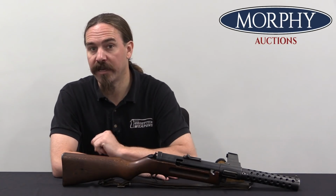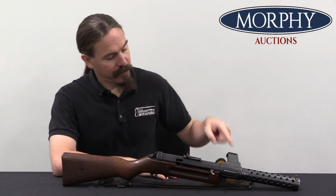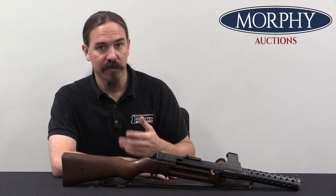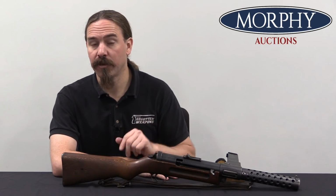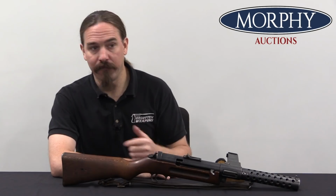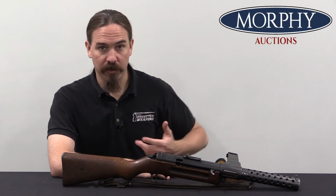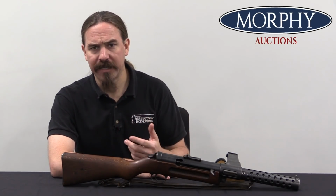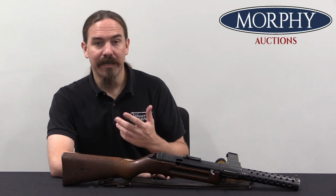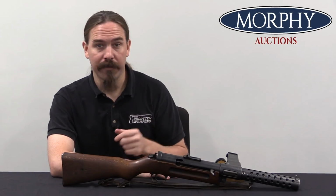I'm Ian McCollum and I'm here today at Morphy's with an MP-18-1 with Schmeisser's box magazine improvement to it. Now, when the MP-18 first saw combat use, when it was first developed during World War I, it was built around a Luger, quote-unquote, snail drum magazine, a round single-stack 32-round capacity drum that had been originally developed for the artillery Luger. It was a magazine that was available, that was in production, and thus made logistical sense for the German military to use, despite being expensive, way too complicated, and just a really awkward magazine.